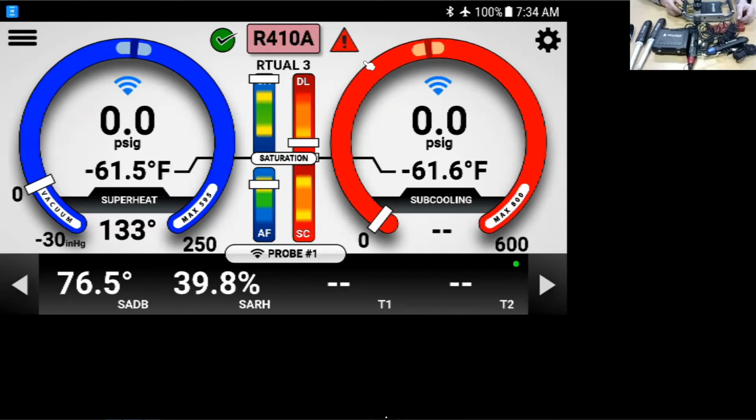And the best place to put the repeater is going to be where you think that you're going to be losing your signal, whether it would be best in a windowsill if you're losing signal from inside to outside. If you're working inside of a freezer with thick wall cabinet, right outside the door of that. Just the best spot that would be the straight line signal to keep that connection.